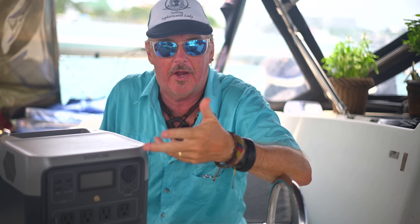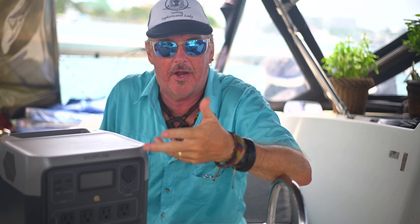Not only does this have a very powerful 800 watt inverter built into it, but it also has a 960 watt battery charger built in, so you don't need to carry around a separate brick just to plug it in when you want to charge it from household current. All it needs is a regular AC cord just like you'd use for a computer, and this will charge the unit up in just over one hour from empty to full. Most of the ones I'm using now always have a small separate brick that runs at about 200, 300, maybe 400 watts and it takes hours and hours to recharge, whereas this one if you're in a hurry, it's built in - that's a huge advantage.